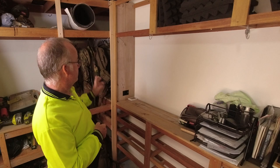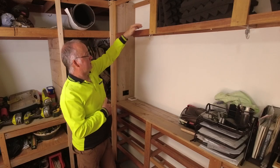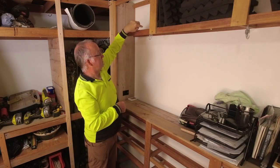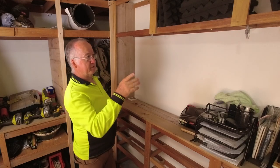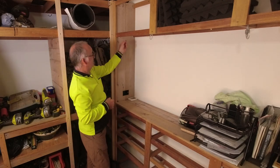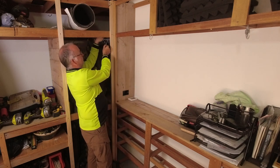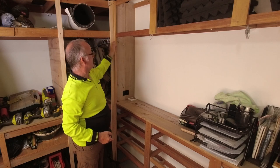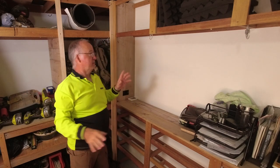I've made a few decisions about what I want to do next. Where these cables are — when I put the shelf on here it's going to be sitting on the cables. I just want to put a groove in so the actual cable sits in the frame and then just pin the loose end up on the inside. I'm also going to have to drill holes all the way through into the back so the lighting will be connected from this point to here.